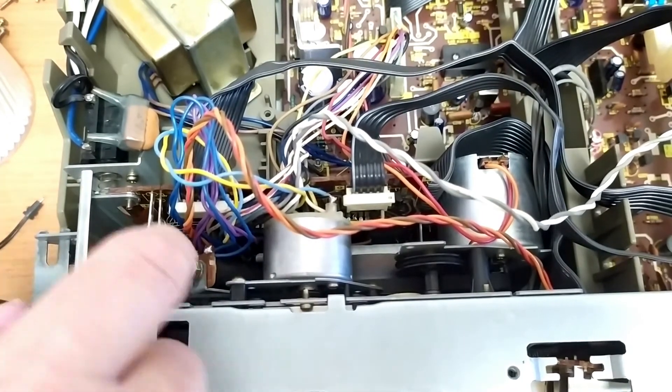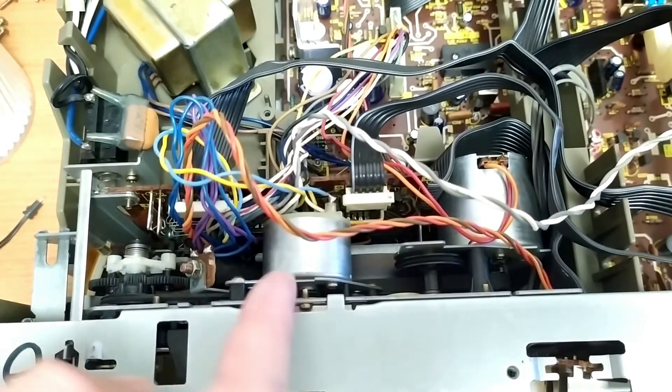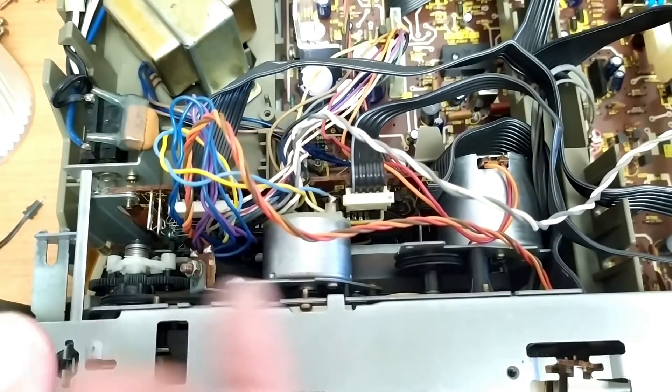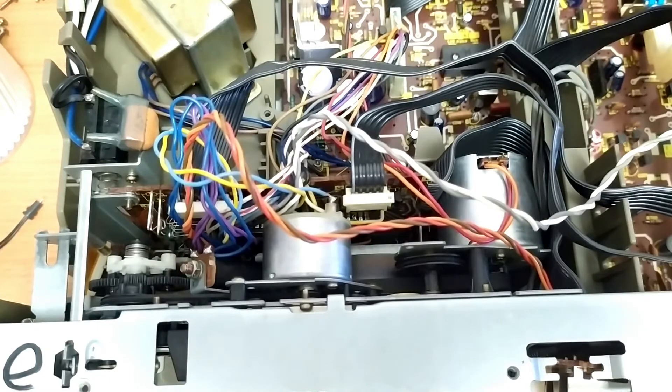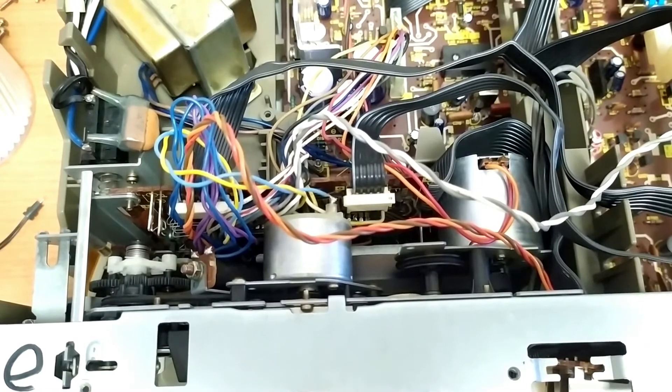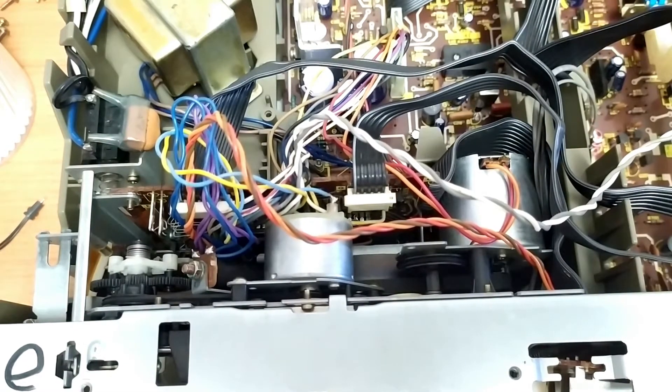On the other side there's actually a small pendulum with a wheel. This actually has a geared tooth on it and it drives another wheel, and when it moves I think that's what makes contact with the rewind capstan. That was very, very stiff, so I had to disassemble that, re-lubricate it, put it back together, and now the rewind is actually working — because after I put it all together, the only thing that didn't work was rewind. Without the tape in there it would go, but it just didn't have enough grunt when the tape was actually in there. That seems to be fixed now.